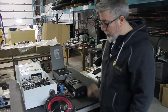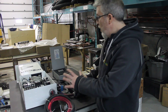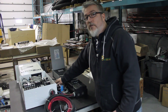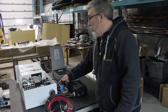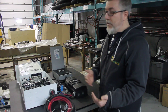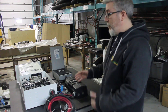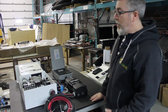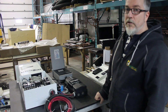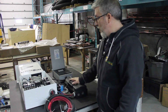The client is just going to have to hook up and get going. And we also have the AGS — the Auto Generator Start — which is going to monitor the battery and send the signal to start the generator whenever the batteries go down too low and the sun isn't there to provide charging. We have a generator on backup ready to provide enough power to recharge the battery.